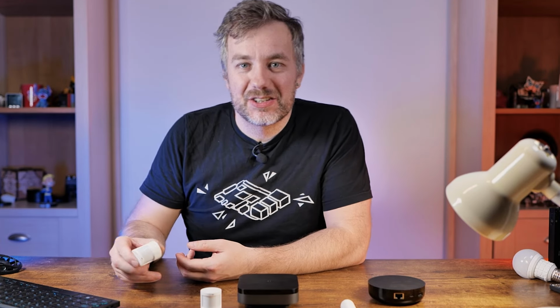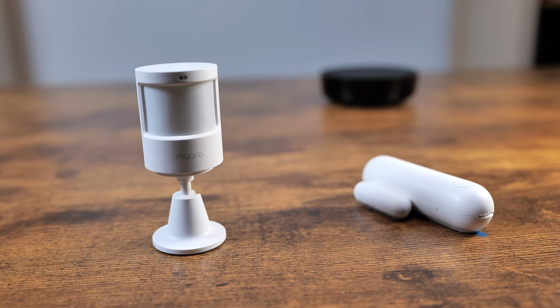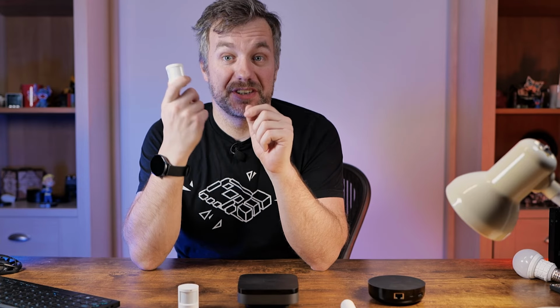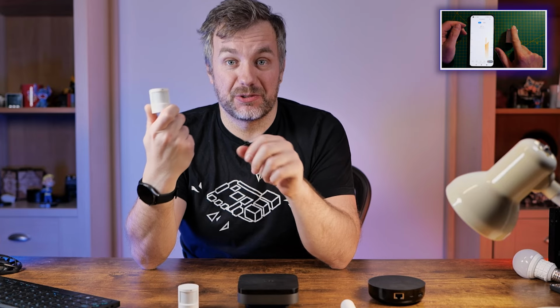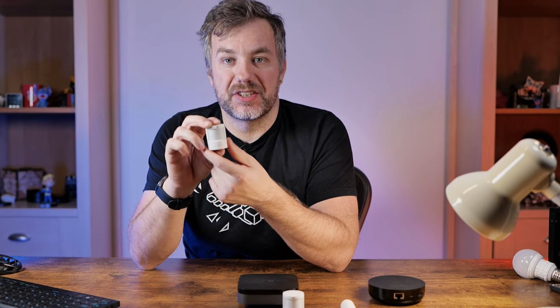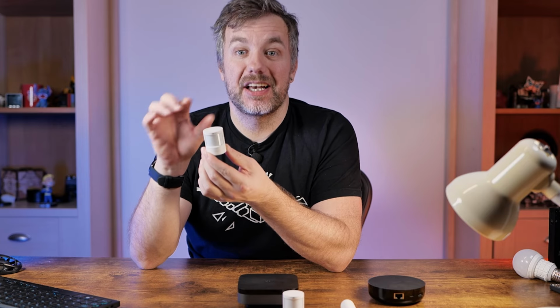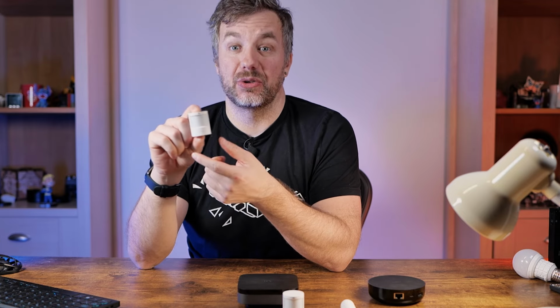And while I'm complaining, let's talk a little bit more about the P2 Thread sensor, the PIR sensor, which I'm slightly disappointed with, because you remember the P1? The P1 got a glowing review from me because you could set the timeout to 1 second, and that was quite impressive. This is the fastest Zigbee PIR sensor that I know of. So if you're looking for something with a great timeout setting, that's the P1 sensor for you. I was kind of hoping that the same would be exposed in the Thread P2 version of the sensor. However, this is not the case, and after linking it to the Aqara app, I discovered there are no settings for timeout whatsoever, so the P2 version of that sensor is set to a 1 minute timeout and you cannot modify it.